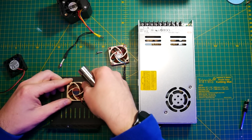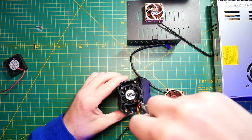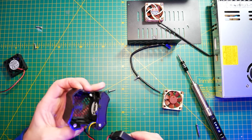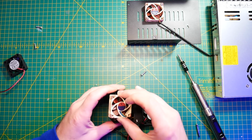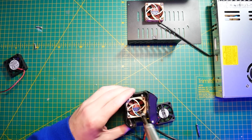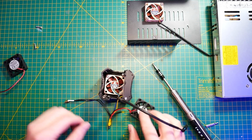Let's put the brakes on the Ender 3 right now, because we're going to change printers and apply the same modification to the Ender 3 V2. Just as before, I'm going to need two A4x10 fans from Noctua, one for the extruder fan and one for the electronics to cool the box inside, and those replacements are straightforward. All you have to do is power them up with 12 volts, and, well, they fit into place without any problems. But we won't be able to use the same hack we used on the Ender 3's power supply because it's located at the back underneath the printer itself, and we simply don't have the space.